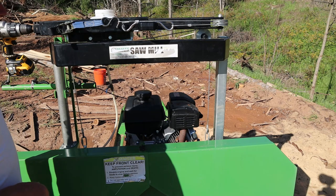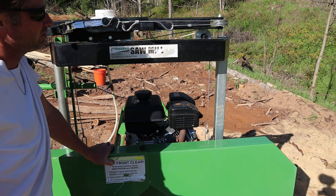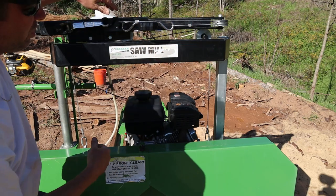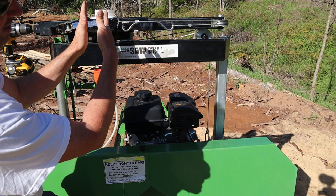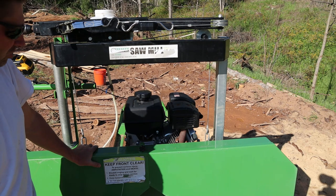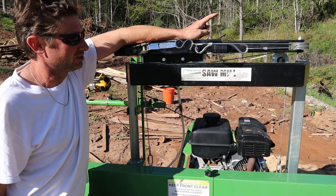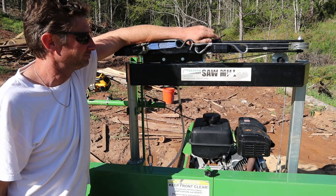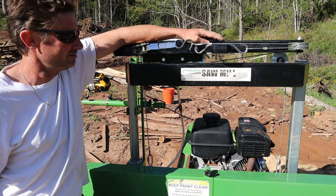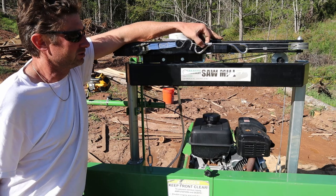So, all right, I'll look for some really heavy duty shocks. I mean, if I want to put shocks up here, some gas struts, I'm going to attach one here and one here, and when it contracts or compresses, the shocks are going to counteract it and push it back the other way, taking some stress off of this point here. I'm gonna get a set of 100-pound struts, like 100 pounds each, and I'll mount them off center. So if I needed to double up some struts, which I don't know, just from the weight of it and everything, I just don't feel like this thing is holding that much.